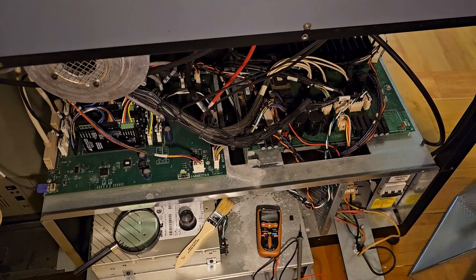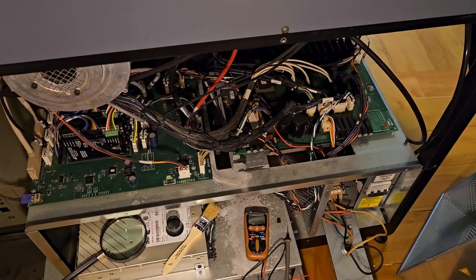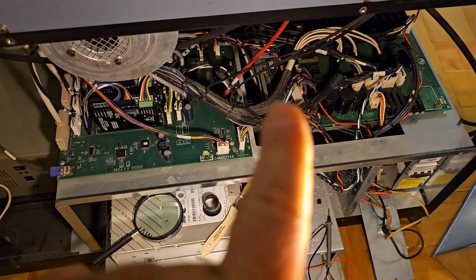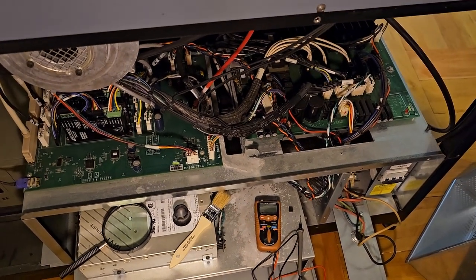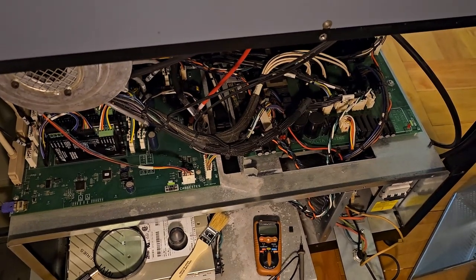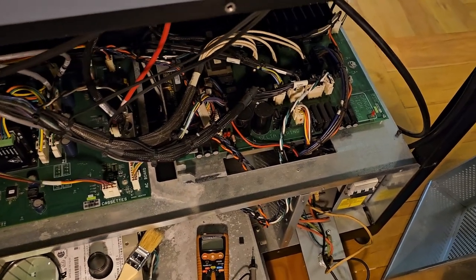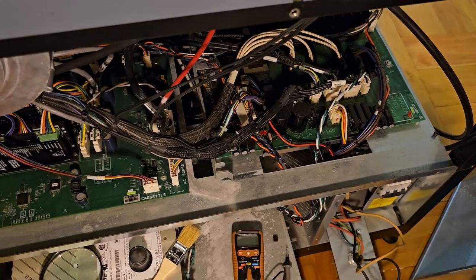If I do, then I have to shut this down, shut down the circuit breaker on the three phase panel, and then shut down the three phase panel and plug that connector back in, and move on to the next one. I don't want to be disconnecting connectors while there's electricity in the system, because that could cause some problems with components on the PC boards. So all I'm doing is interrupting the power supply by doing it this way, and the electricity will only go that far and no farther — we can check it at each step along the way.